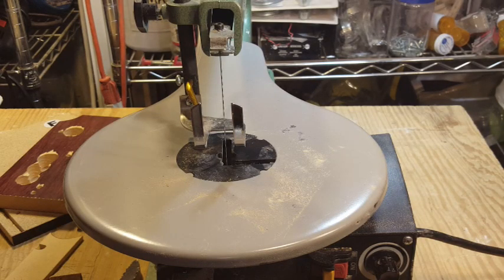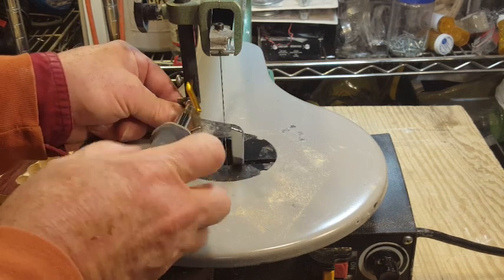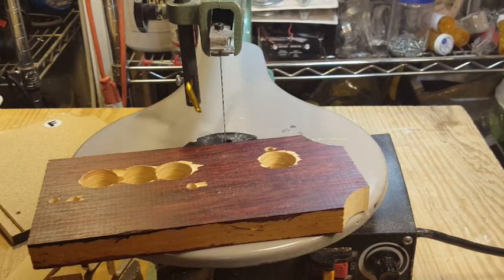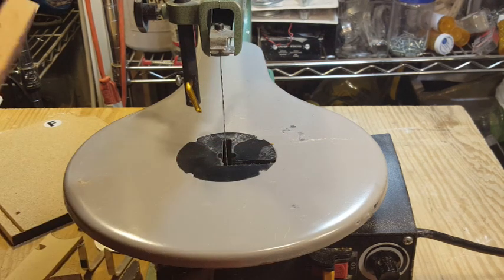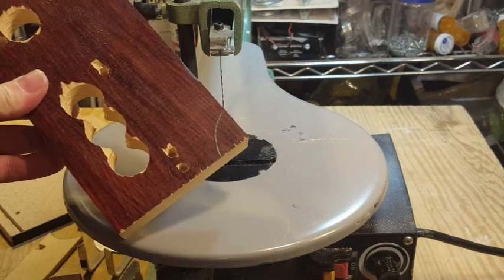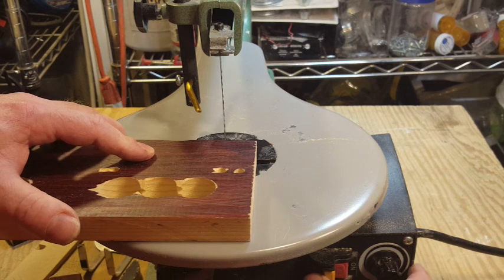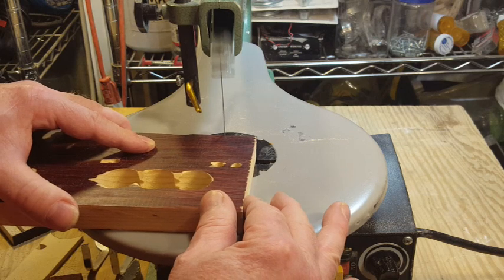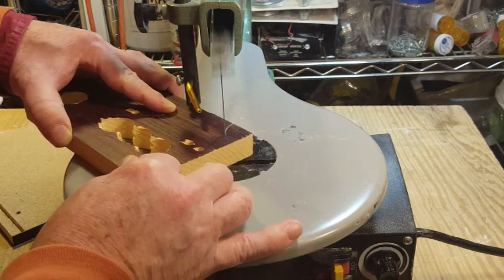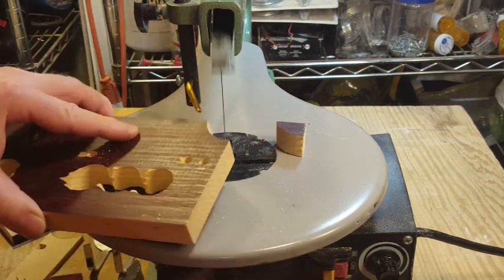Now I'm going to remove the foot. I'm wondering — and maybe some of you are too — if I'm cutting relatively soft wood, how much do I really need this hold-down foot? Let's go back to the three-quarter-inch pine, put another curved line on it, and try to cut it without the hold-down foot. We'll see if the piece bounces around. No problem at all.